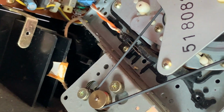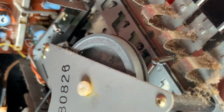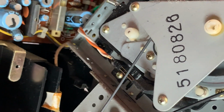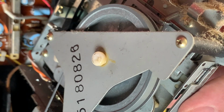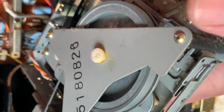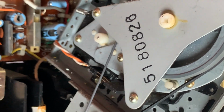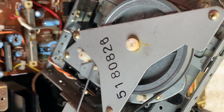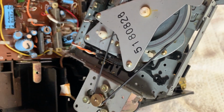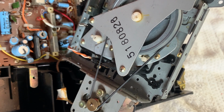So if you wanted to change the belt on this, and incidentally I'll go in and get rid of all that dust and stuff afterwards, you've literally got your 3 little screws. You can just see one there, and then one on each corner of the keeper plate. You can see the thrust adjustment screw just there. I'll just zoom out a touch. There we go. So you'd literally just pull that off, and there's your belt.